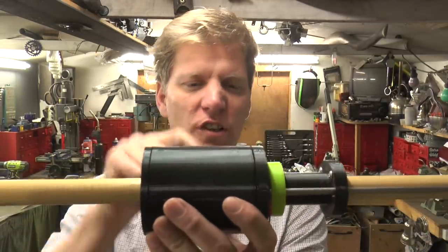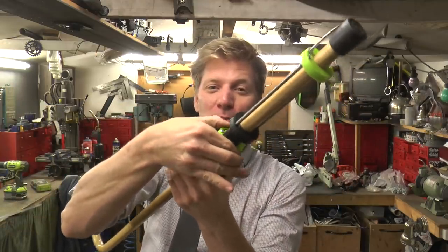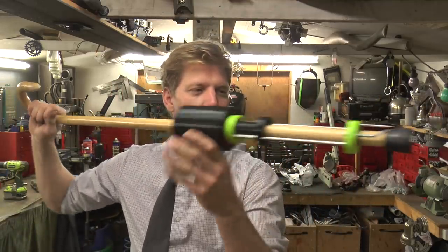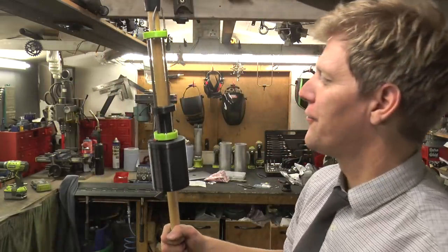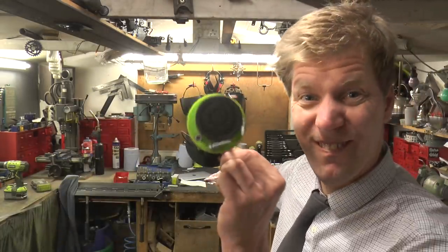Also the battery needs to fit in here a little bit better, and the thing I've completely overlooked is there's no trigger and nothing to push this bit down here. I need another orifice and another rod to go along here. I can push it in and it will pull it out and spring back automatically. But there we are - 3D printing exercise one, not too bad, at least it works. Get on the computer, redesign them, and print the whole lot off again.